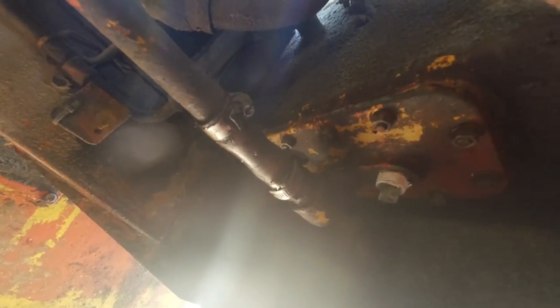The hydraulic oil is at the right level now, so there's two taps, a minimum and a maximum. So you want to get it somewhere between there, probably just on the maximum, because there are a few leaking rams, so that'll give me a bit of leeway.